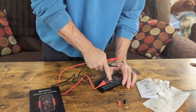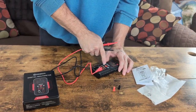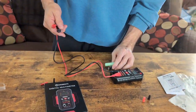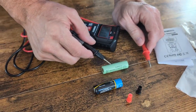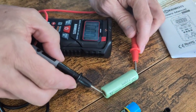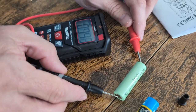So let's say you want to check something. We're going to use it on auto — go back to auto. We are going to see if these batteries are good. So we have two batteries: one should not be good, and one should be. We're going to check the volts on these two batteries. I know this one is not working and I know this one is. I have it on DC right here. So I'm checking this one — it has 0.023 volts. I've tried charging this battery and it doesn't charge, so it's probably not any good.